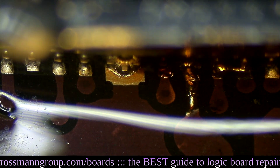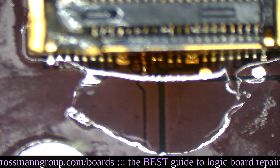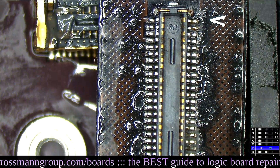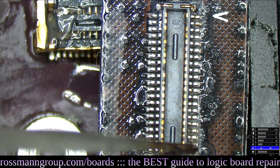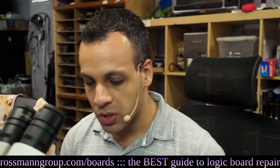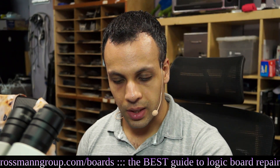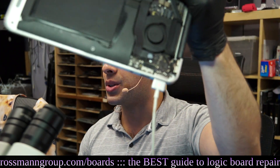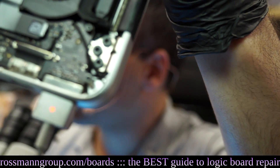The first thing I'm going to need to do is replace that DC in board cable as well. Because if you look, not only was the connection on the board broken, the cable itself looks corroded and missing pins — this one, this one, this one, this one. So I'm going to get a replacement cable. Let's see if this works with the new DC in cable. And there we have it — not only do we get a fan spin, but we get a light on the charger.